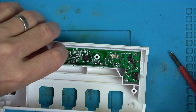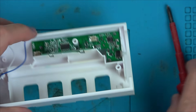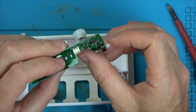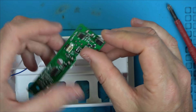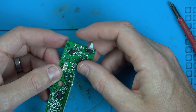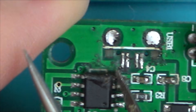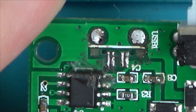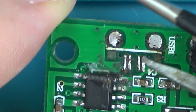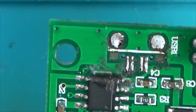These must be the little UV lights down here on this board. I can see a hot soldering iron has been on here, but it looks like it might just be a ground pad that ripped off — it might be okay. I'm going to get the soldering iron on it and try to clean it up a bit, adding some flux. Let me try to clean them out — I think that's going to be intact.